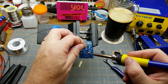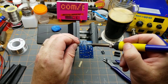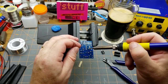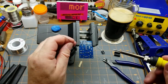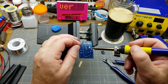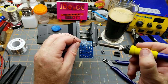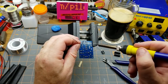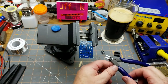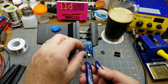I'm going to want to be a little bit careful when I'm soldering those transistors. They're not that fragile, but they're the most likely to be affected by heat of anything I've done so far on this board. What I'm going to do is go on one for a little while, then come over here for a little while — just sort of move the heat around so that nothing gets roasted for too long and has a chance to cool in between. That may be overly cautious, but it's a habit born in my younger days when components were both much more expensive and much harder to come by.